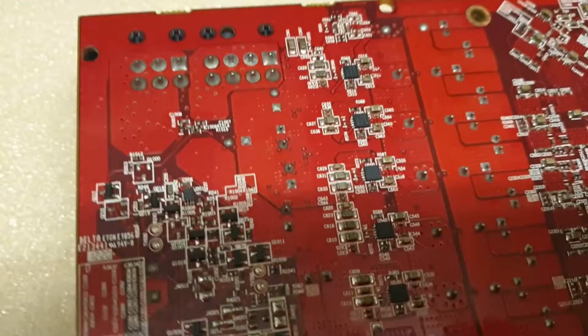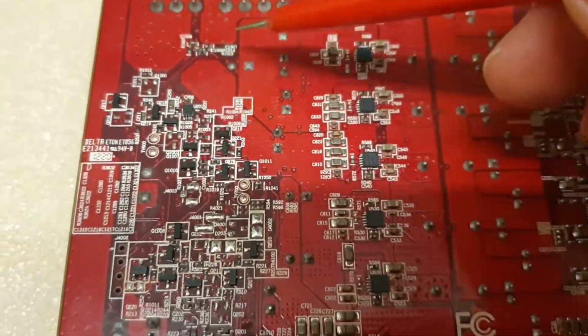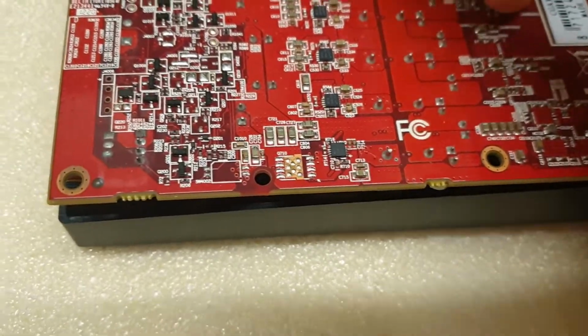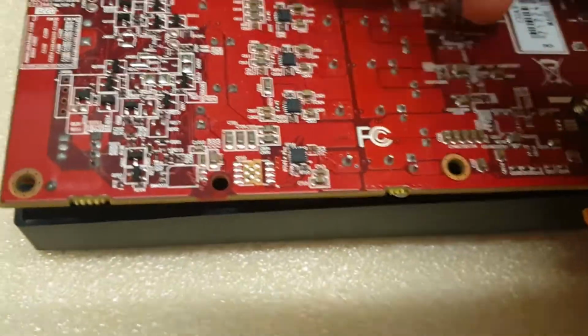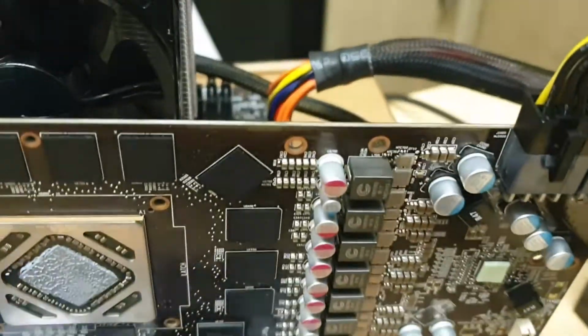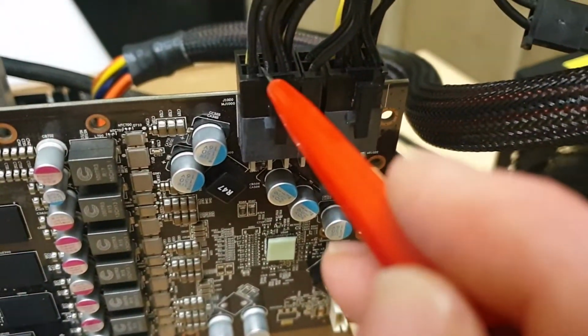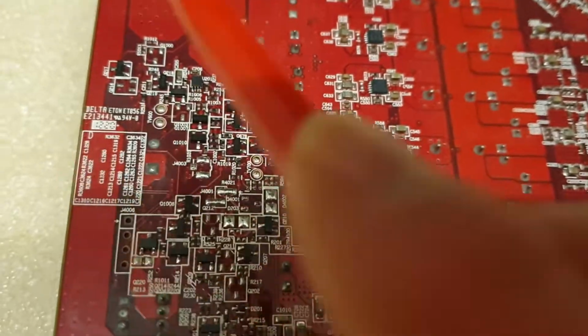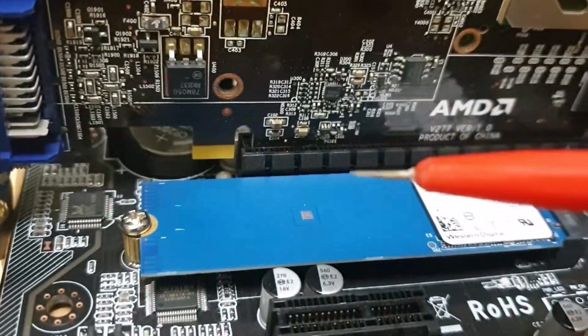So basically this power good signal is divided from these two connectors, and I got this card here just to show you. See all these transistors around? Those transistors are basically sensing 12 volts. There are some voltage divider resistors, and then it divides the 12 volts. So you should have something about 12 volts in order to get power good signal, and then you should have this grounded middle pin. If you don't have them, the card will not turn on because it's missing these connectors. So basically all this bunch of transistors, that power good signal coming from here, basically coming here from here.